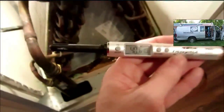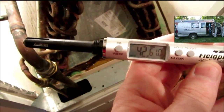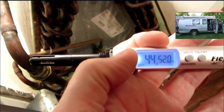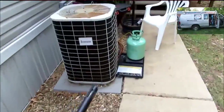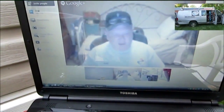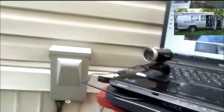Hey guys, I've got the PRH2 here getting my indoor wet bulb. Looks like we're going to be 61. Taking in 75.5. Okay Fritz, I got the indoor wet bulb. What you got there, Ray? 61. 61 on your brand new PRH2. Did you set it to outdoor dry bulb yet? Yes, I have it set for that. Okay, let's get our dry bulb and everything. You've already got your scale hooked up and your Testos ready to rock, so let's get our outdoor dry bulb.